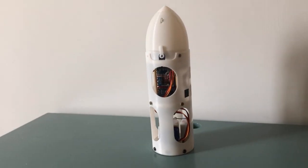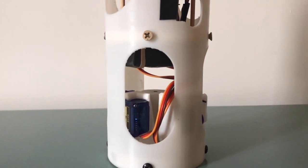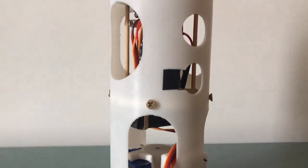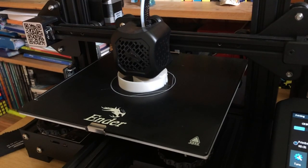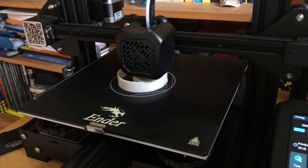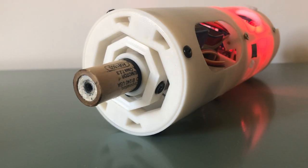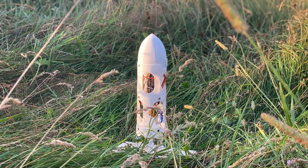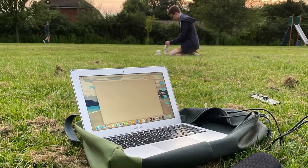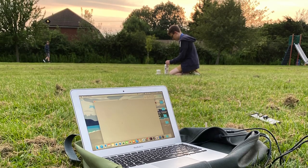This is an actively stabilised thrust vector control rocket that I have made over the last few months. It is fully 3D printed in polylactic acid and has a dry mass of 245 grams. Powered by an SDC6 rocket motor, it reached an apogee of roughly 37 and 39 metres on flights 1 and 2 respectively, and was successfully recovered on both flights with two 15 inch parachutes.